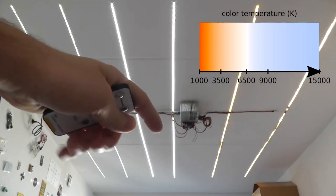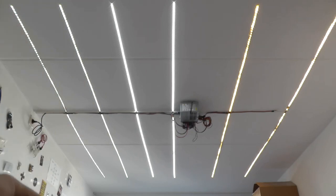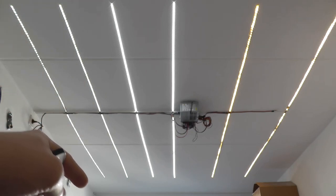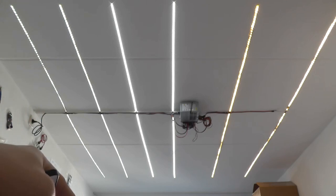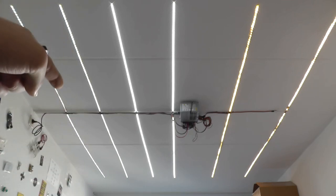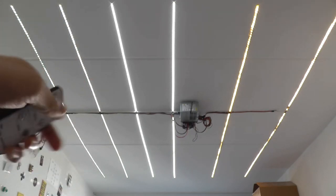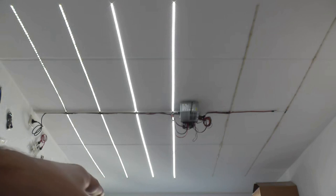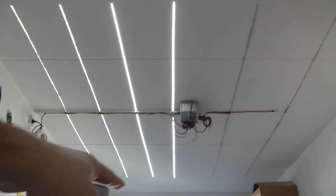In the center I have normal white LEDs at around 6000–6500 Kelvin, and on the right, warm white LEDs at around 3000–3500 Kelvin. These LED strips are not too expensive — between $15 and $25 for a five-meter strip. I cut each strip in half so each line is two and a half meters. The idea of having modes is that I can change the ambience of the room.